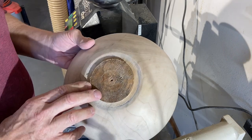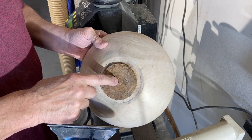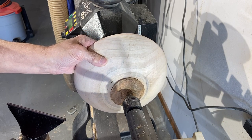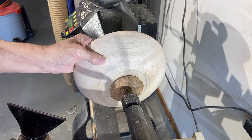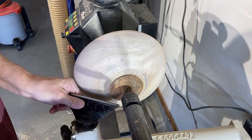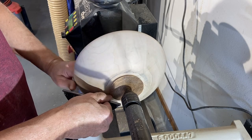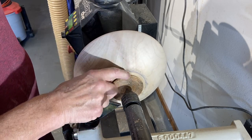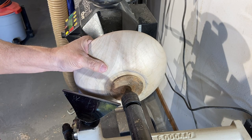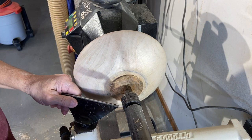It's very important when doing any work on the lathe to always leave your center point mark, because that mark makes everything else so much easier. You're going to come right in here and set that right on there. Lock the tailstock and tighten it up. I can check right now to see how close I am — I'm just touching my fingernail to the side of this, so this is exactly where it needs to be. I have not turned on my vacuum chuck yet. I could use it right now as a jam chuck, but the vacuum chuck just makes it a stronger setup.